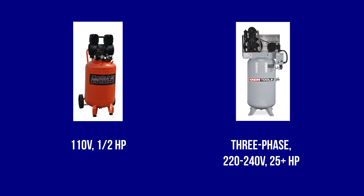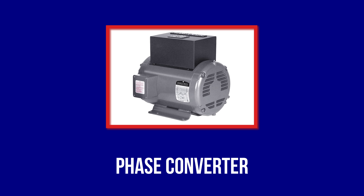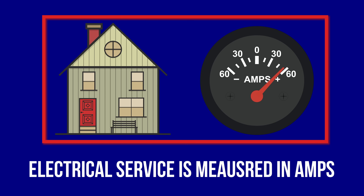Finally, you need to know your shop or garage's electrical supply. An air compressor motor ranges from simple 110-volt, half-horsepower versions all the way up to giant three-phase 220–240-volt monsters that make 25 plus horsepower. The electrical service available to your house or shop dictates the largest compressor you can install. The electricity supplied to most residential properties consists of single-phase voltage. The electrical used in heavy industry is generally three-phase power, and few if any homes have three-phase electrical capability. There are converters available that allow you to use three-phase motors in a building wired for single phase, but it's best to begin with a single-phase model.